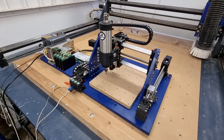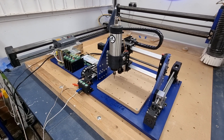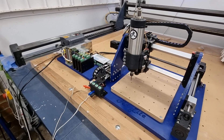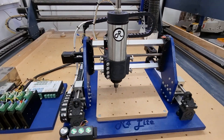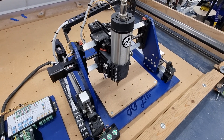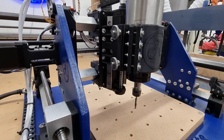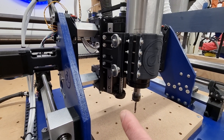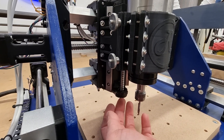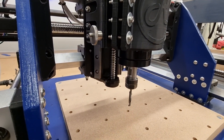What value needs to be set there — I've written a little program that helps me work that out. It generates a little bit of test G-code that you run, measure it, put that figure back into the software, and it tells you what the offset correction should be. Very handy, but probably outside the scope of this video. There'll be a link in the description where you can check it out on GitHub. Wiring's all the same, spindle's the same, and there has been a minor update to the Z-plate, just to put a bit more plastic around the bearing idler — I've managed to snap it off a couple of times. Check out the updated version on GitHub.